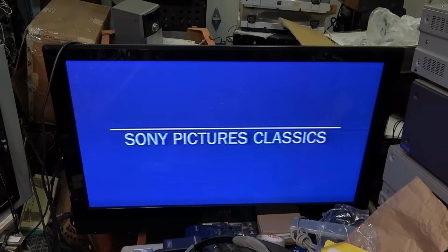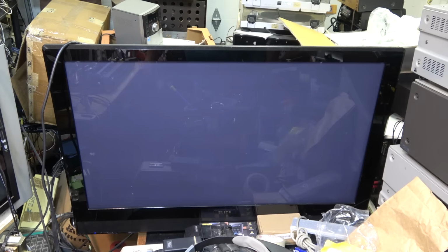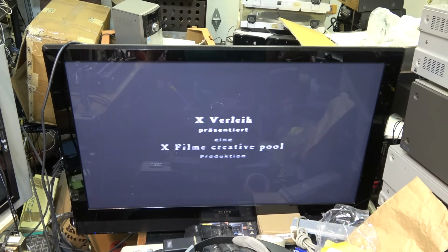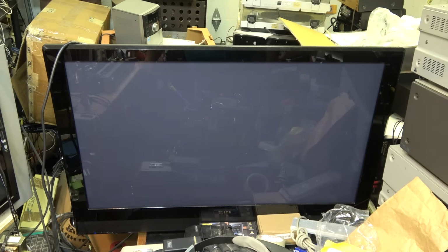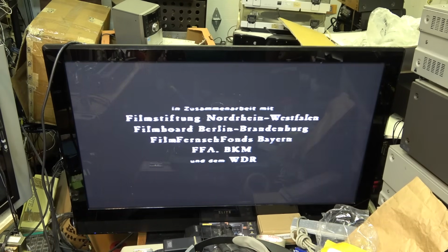All right, I just was chasing after a tape problem. I couldn't hear it so much. This is an EP tape that's playing now. It was something recorded off TV, I guess. But this is just another tape that I found here. It was recorded in EP. I couldn't hear it when the AC was running, but I could hear this howling sound. And anyway, it was the tape.